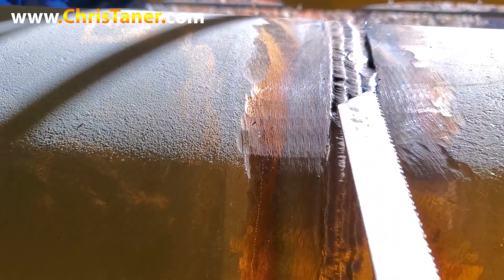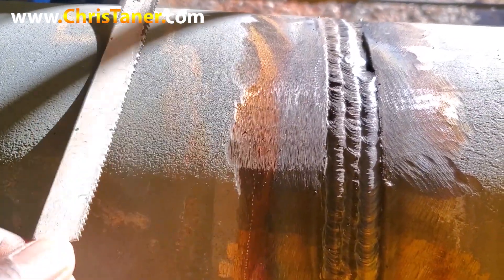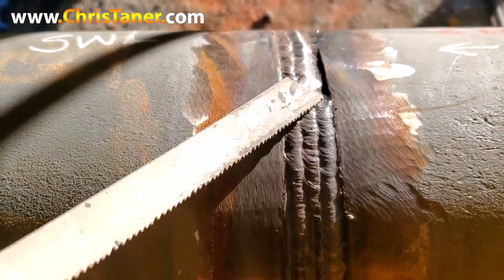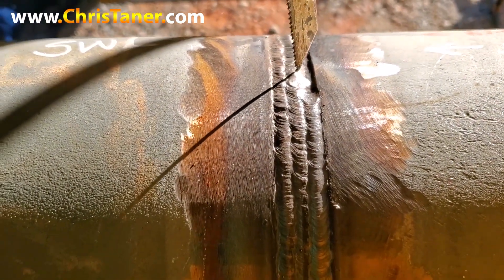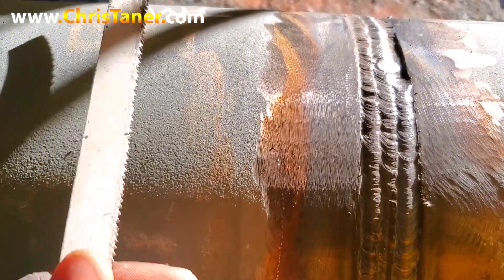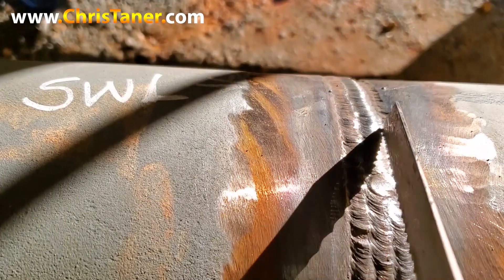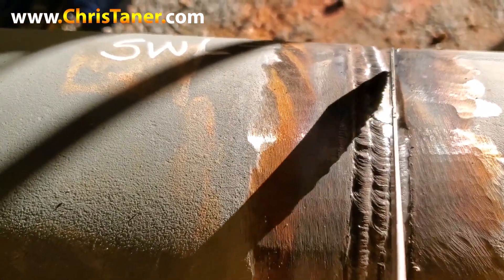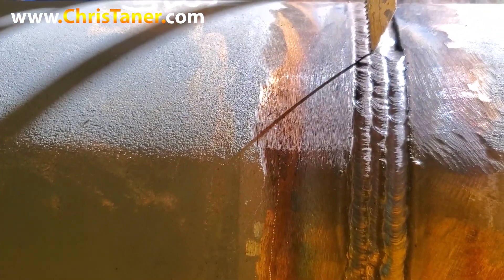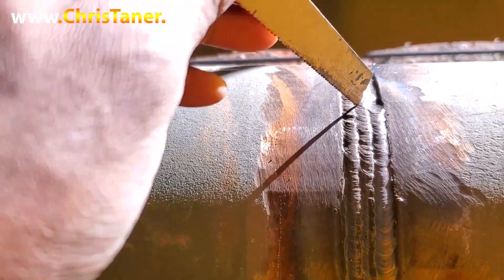So try this. Just to recap real quick, what I'm showing you is a small technique that really helps. Some jobs you go on, they don't want you to flush the entire pipe out with the 70S2 with the TIG — whatever you're doing — they don't want you to actually fill out the whole pipe with that TIG wire. You can either fill it out halfway, or like I did, a lot more than half. But you have to go in there and use that 7018 at some point in time, and that's before you flush it out. It's just a little technique you can use to lay down more material and get everything where you want it to go.